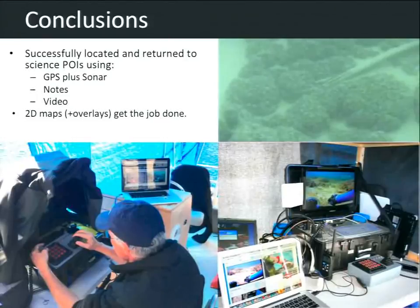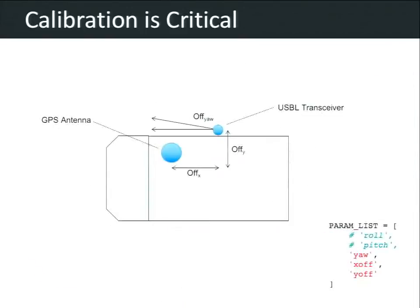So should we take, did you have a question? A question about the sonar and the technique that you explained. Wouldn't it be more accurate to have 3 GPS and 3 sonars and 5 delay? Yes, definitely. This technique is called ultra short baseline sonar, and it's done because it's relatively straightforward and easy and cheap. The other thing, long baseline sonar does exactly that. There are several beacons spread around the lake, and it does the same kind of triangulation, and it is much more accurate. It's just more expensive and difficult to set up.